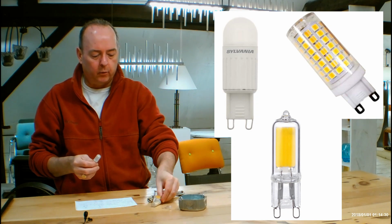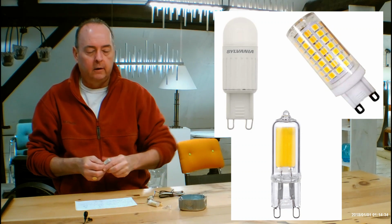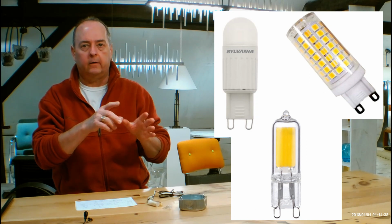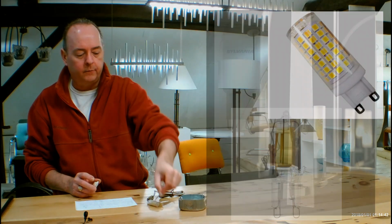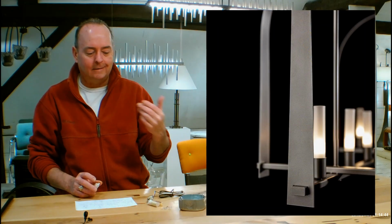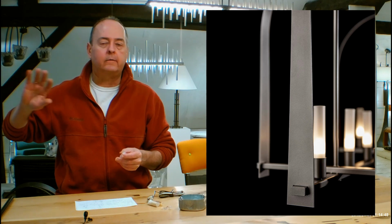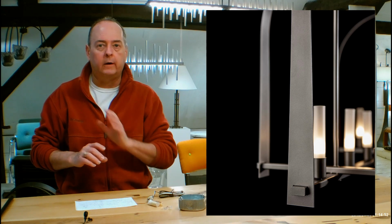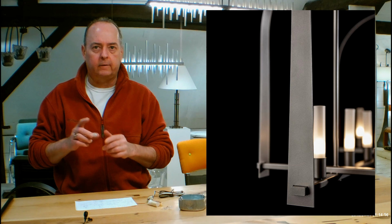But what's really important is you want to zero in on the color of the light to begin with. 2700 Kelvin that's going to be offered is going to be like the setting sun. It's very orange. That's actually the same color of light that comes out of halogen bulbs, just so you know. That's 2700 Kelvin or incandescent bulbs. And then way on the other side of that is called daylight. And daylight sounds warm. It's not warm. That's kind of a cold hospital waiting room light or an overcast day. That's going to be 4,000, 5,000 Kelvin. You'll see that offered there.